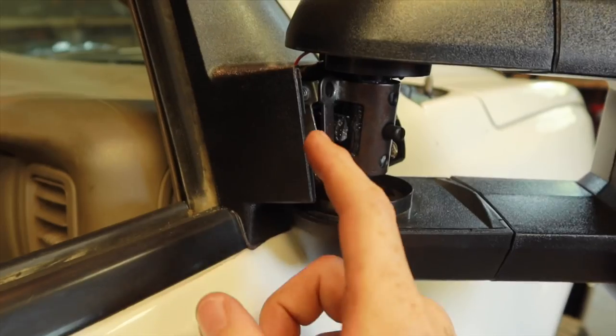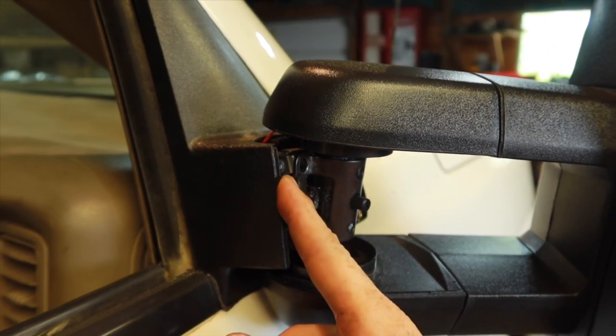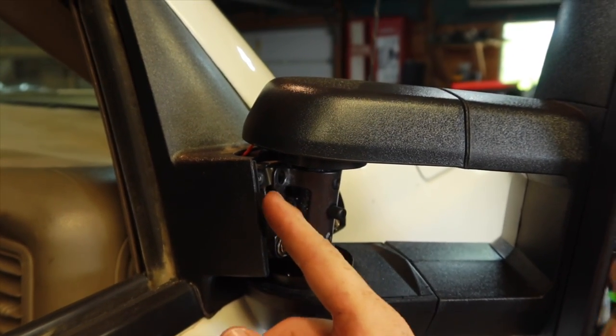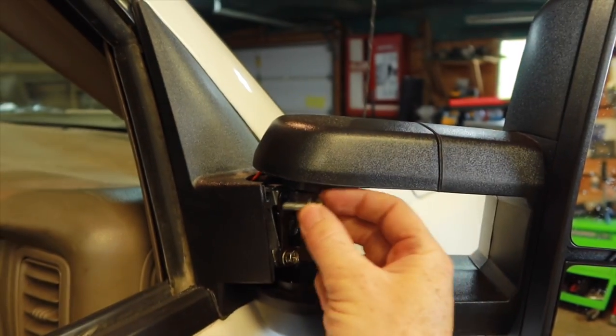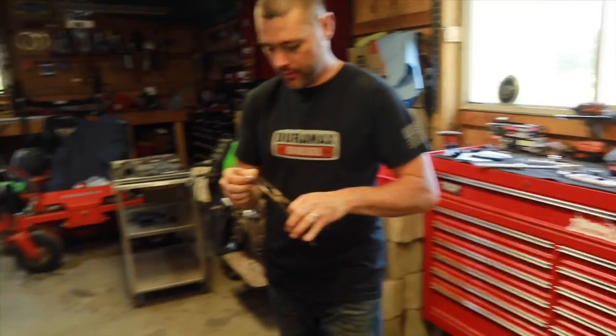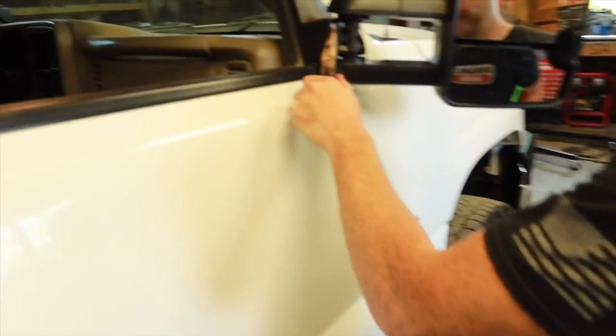What we're going to do is squeeze two washers in — I'm going to go two first. Put two washers inside that gap, put the bolt right back in there, then go ahead and tighten everything down. I'm going to use some needle nose pliers to stick it back in there just for a hand.